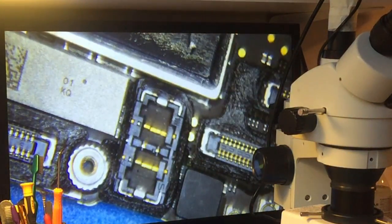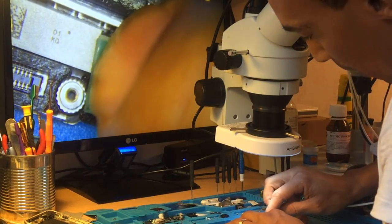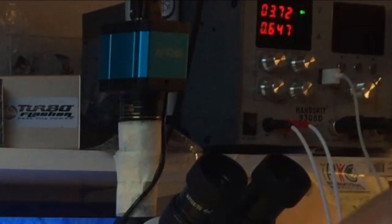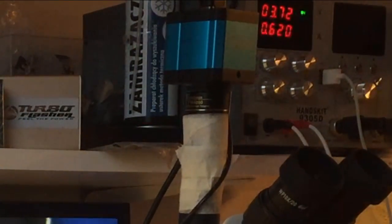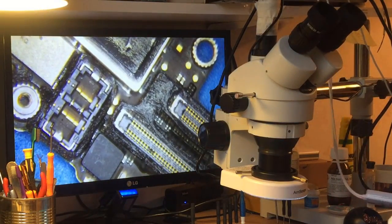Let's connect our phone with a DC power supply. It's the iPhone 7 and 7 Plus — let's connect our phone to our DC supply like this. Now we have to watch the DC supply. The DC supply shows measurements like 650, 642, 4138, and then it goes down. The reading in the power supply shows that there is a short — there is current going out.